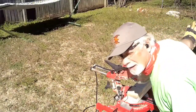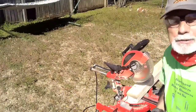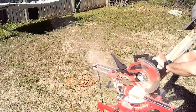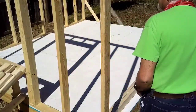I'm making sure that my ends down there are even before I cut this side. I got this thing plugged up now. It's just a matter of putting them in place, labeling them as sole plate and top plate, and then starting my 16-on-center layout on each one. Since this is a weight-bearing wall, I'm going to do 16 on center.